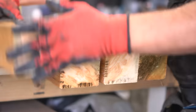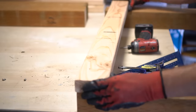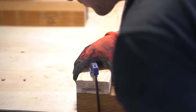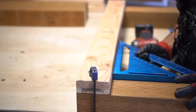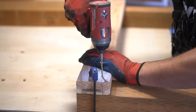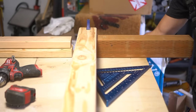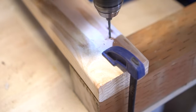For the base of our structure, we have four legs as well as four sides, and we have to put these together. The most important part is to make sure that everything is square, because if it's not square now, your structure is never going to be square. In order to check for square, I'm using a speed square. You can also use a contractor square, but this really helps to make sure that the angle at which I place these 2x4s and the 4x4 posts together is actually at a right angle.